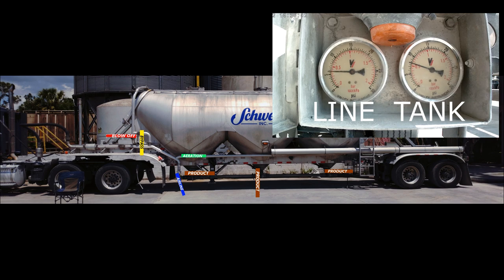You can now hear the vibrators. That's coming from the first pod, because it is empty. And I still have some product weight on the aeration cones inside trailer for second and third pod. That will help shake loose any crumbs left over while my second pod is emptying.